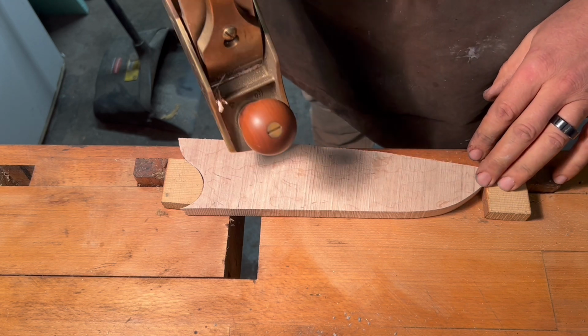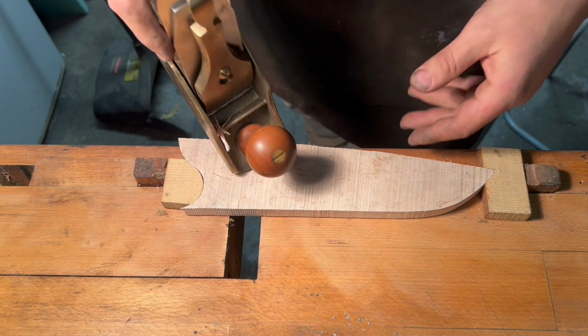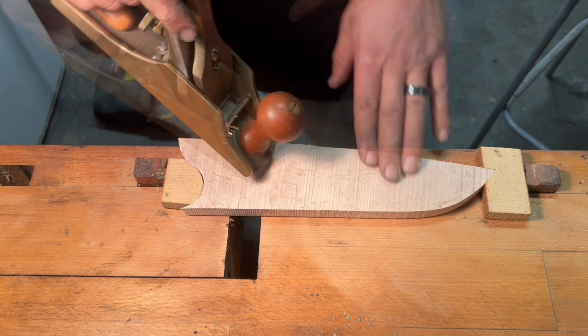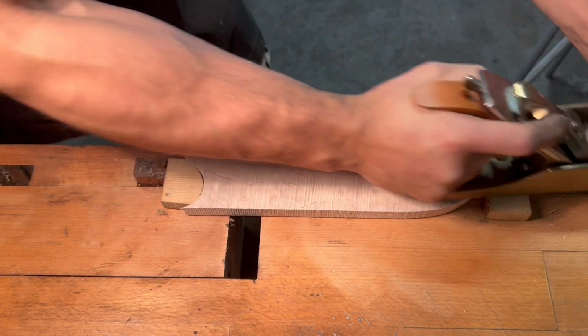Anyway, the reason to use a hand plane over a belt grinder is that a flat platen is never 100% flat, and that will create quite a visible glue joint, which is also ineffective. A plane leaves a clean surface which is nice and flat, which has produced a perfect glue joint.